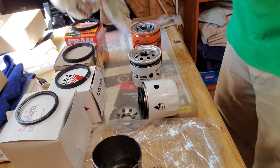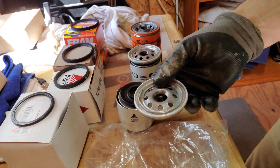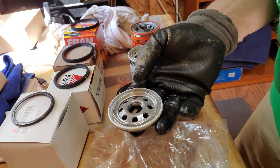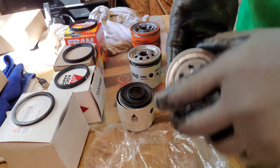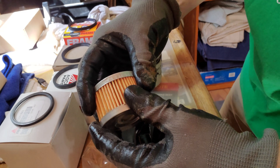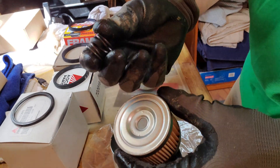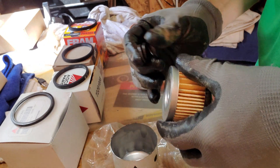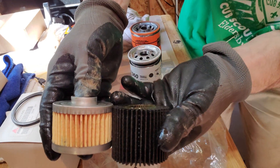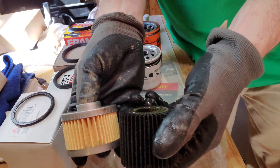Now the other Agco filter — these filters are basically clean. Here's the front plate, which felt like it might be heavier than the Iseki Denso filter. Here's our drain-back valve, and here's the filter. Very well constructed, but much smaller. The pressure relief is built in with a separate spring. So that's the old Iseki versus the new Agco — much different filter. I'll count the pleats.